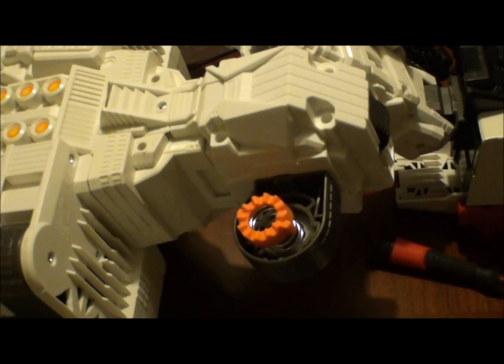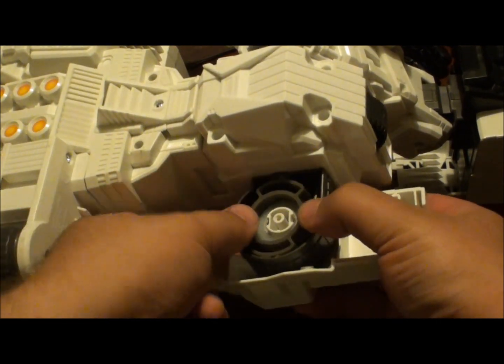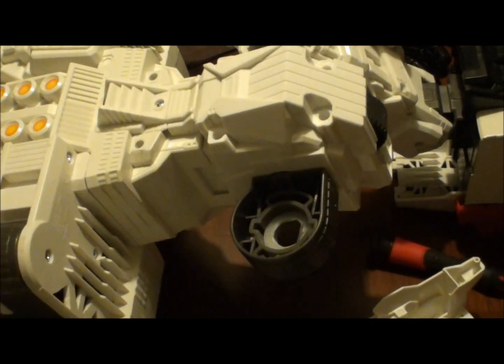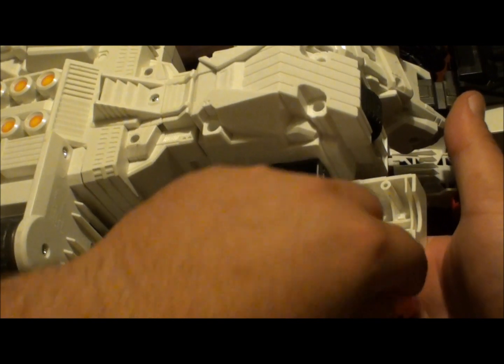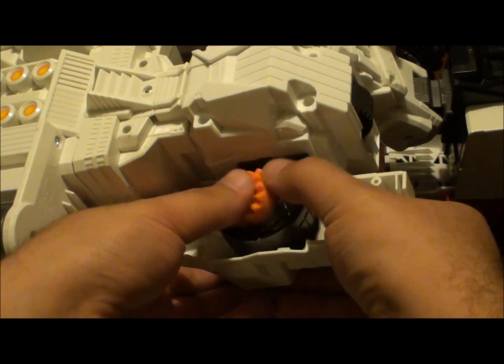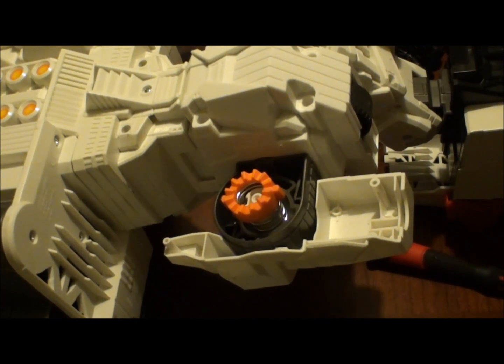And for the rubber flat washers here, notably, this is sized so that the leg panel will still slide back through, and then we'll put our spring on it like this, and then our orange piece will go on here. Really the easiest way to do this is to line it up with the top first and then put it down, otherwise it's going to spin around while you're trying to get the top piece on. But we'll worry about that in a second.